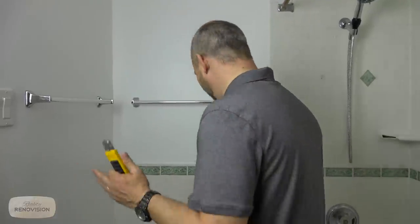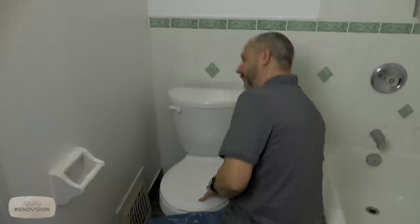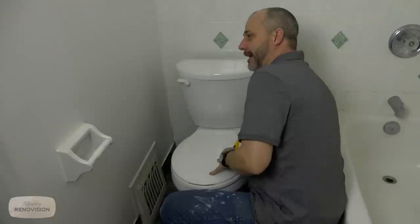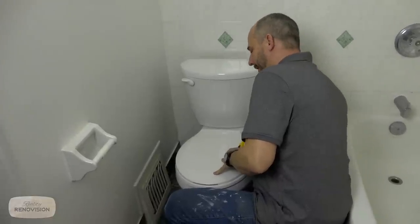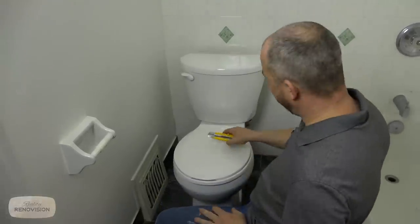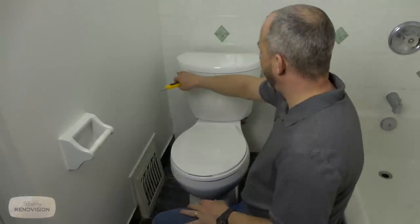The biggest secret when you're doing a demolition in your bathroom is space — you need more than you have. So you want to get rid of the toilet first. Whether you're pitching it or saving it like we are, getting rid of the toilet is always the first step. Remember, before you touch any plumbing, always turn off the water. Because this is a three-story walk-up, we don't have individual water shutoff controls, so we have them all at the source.